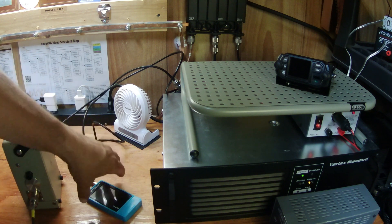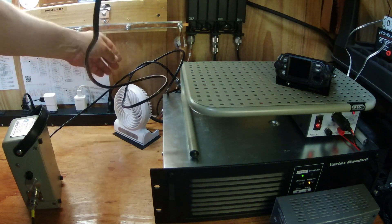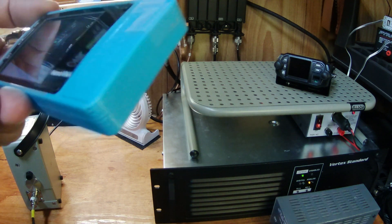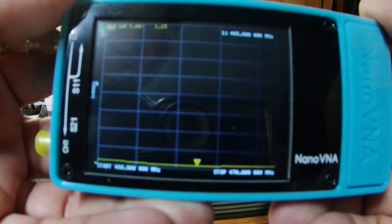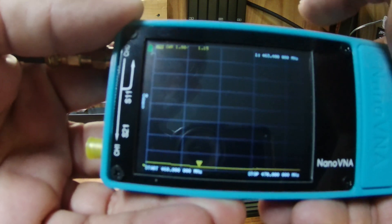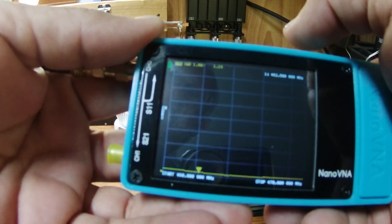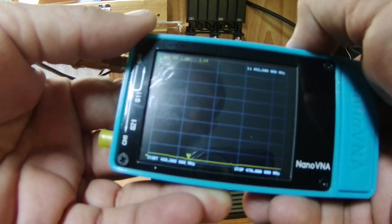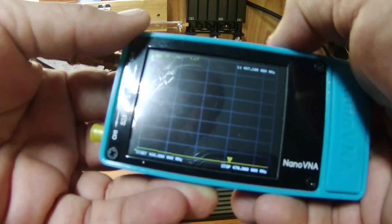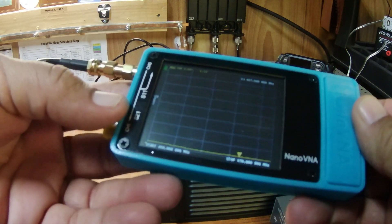Let's make sure the antenna is good. As you are aware, we have a new antenna up top. We have the SWR meter hooked to the LMR 400. Let's turn this on. Getting down into the 462s, we're sitting at 1.18, 1.17, 1.16. Taking it up to 467 to see what that end looks like — 1.17. So we know it's not the coax or the antenna.